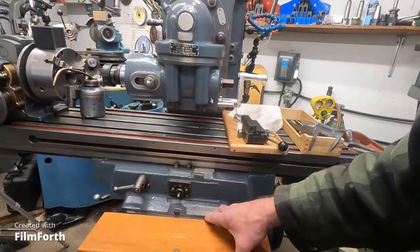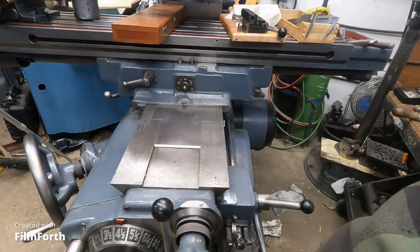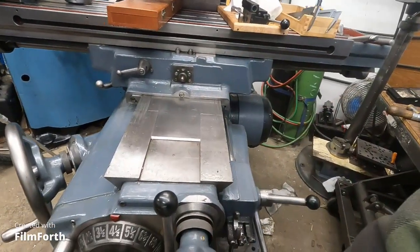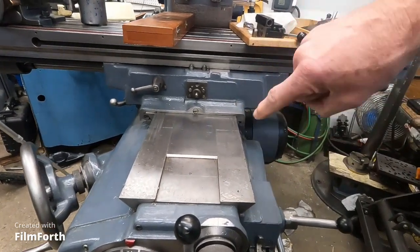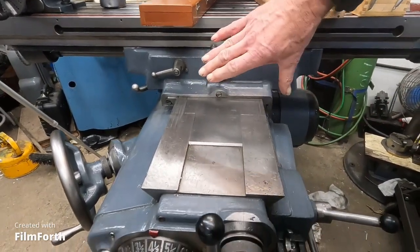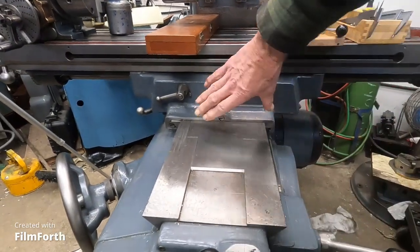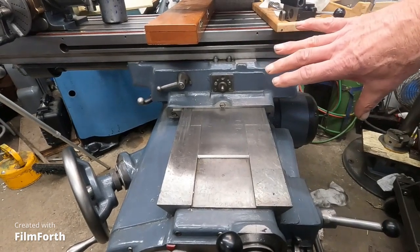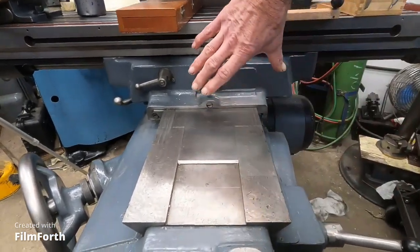You can use these end measuring rods to compensate. It's very simple to compensate for that yaw — if you're going to start cutting and coming this way, you want to run it back then pull it about an inch before the tool enters the cut. Do the same on the Hardinge too, because the hand wheel on the side is pulling then pushing when going back and forth with the needed clearances. On the Hardinge chucker, for best accuracy, I'd move the carriage back about an inch then bring it back — otherwise the yaw straightening out will be in your cut.